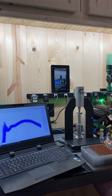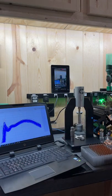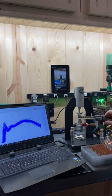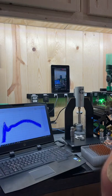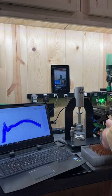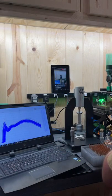Yikes. Look at that. Something way different about that case. Yeah, he's going to go off all by himself. I wonder how the overall length sits on that one because of that. Well, it's not out by a lot, it's pretty much the same. It's right there within a half a thou of my target. So whatever the issue is with that one, it didn't show up on overall length, base to ogive. But we're 94 traces deep here, and that's like whoosh, all off by itself.